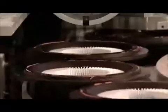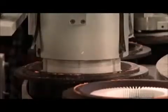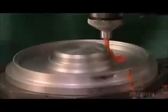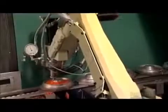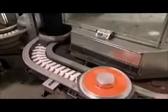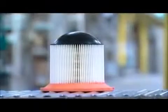The big wheel keeps on turning, positioning the molds to receive more packs, or tubes, of filter paper. The wheel pushes the paper-filled molds onto a conveyor belt. Down the line, a robot pumps a polyurethane mix into the bottom mold for the filter. A worker presses the paper-filled top mold onto it. Heat triggers the chemical reaction that expands the polyurethane, encasing the bottom of the filter paper and forming a gasket that will fit tightly near an engine intake.